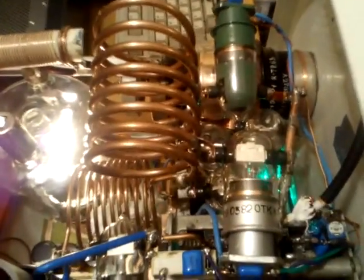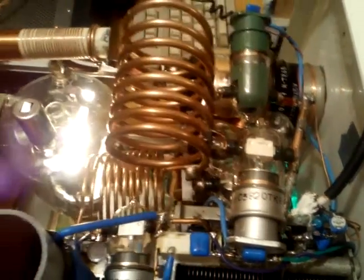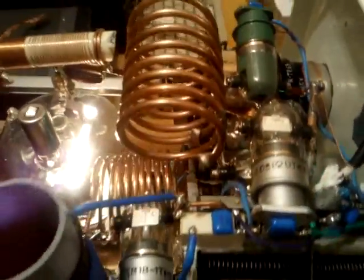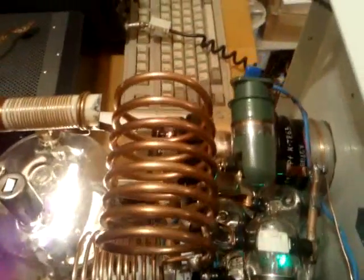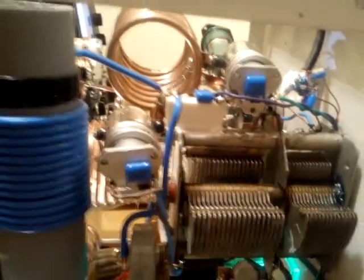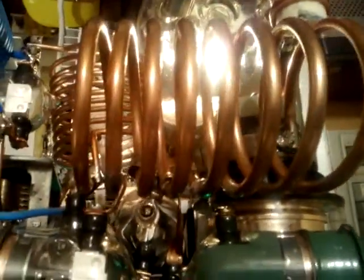As you can see, there is no rotary switch for the Pi filters — it's using six vacuum relays, six vacuum relays from the Russian Red Army. Rotary switches at this time are quite expensive and hard to find, and I had the occasion to buy some surplus components from eBay. Those vacuum relays do a very fine job for the Pi filter of this amplifier.